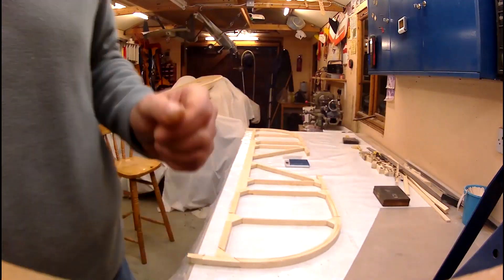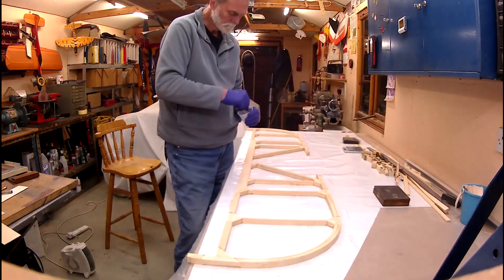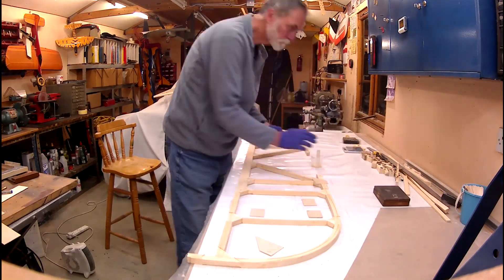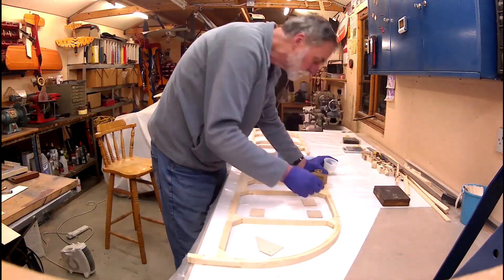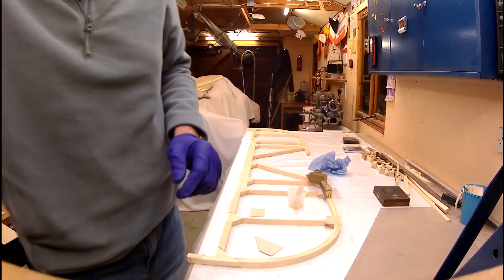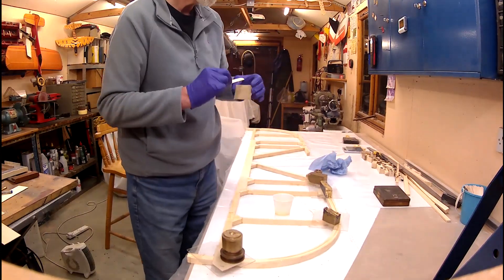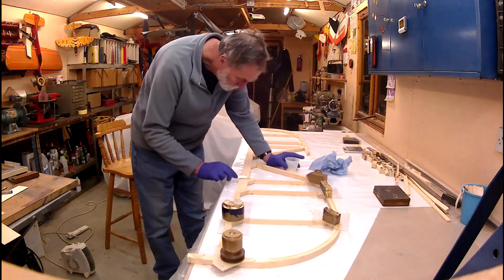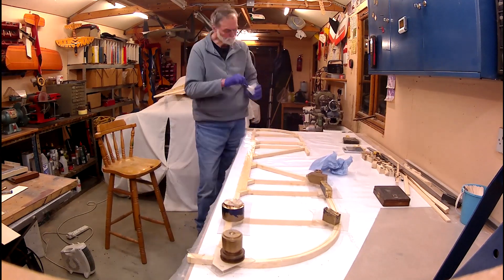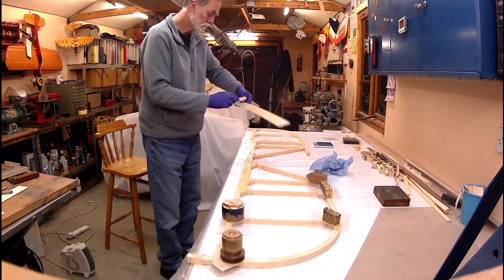Here I'm just blowing off any dust from sanding. I do that before I do any of the gluing — it aids to make a stronger joint, because with a thick resin such as T88 it tends to sit on top of dust. I'm putting this plastic sheeting — plexiglass, thin plexiglass — over the joints before weighting. That spreads the load and keeps the gusset flush with the top of the wood frame.